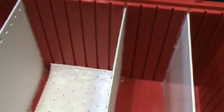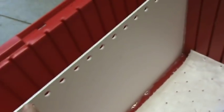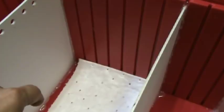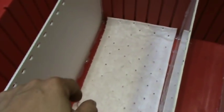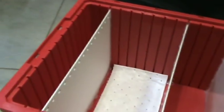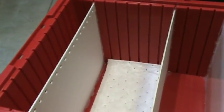To keep the oil cloth from getting into the fourth compartment, I made a line of holes so the water level in that section is lower than the rest — water makes it through to the other side where it's sucked up by a pump for rinsing and the windshield washer. Some companies use a bigger version of this; I'm hoping to get away with a smaller version tucked under the machine to save space, but I may have to go bigger.